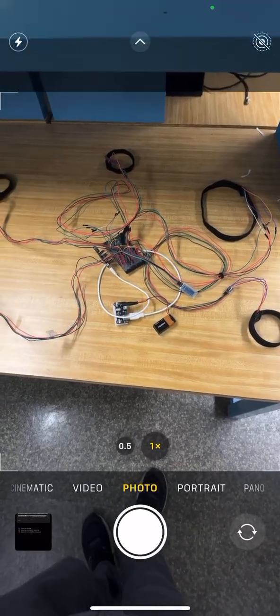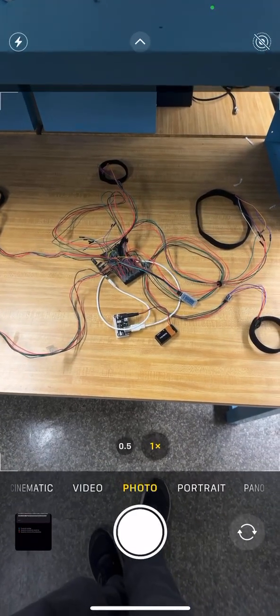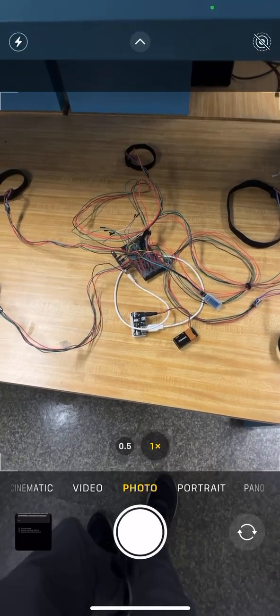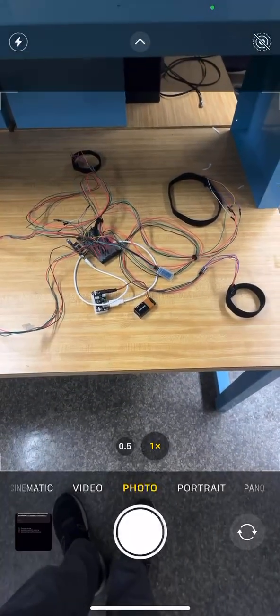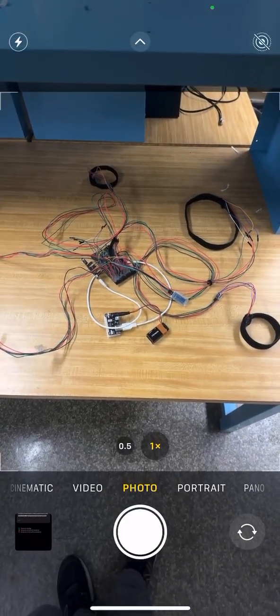Right now it's a proof of concept because the I2C connections are currently unstable and no data is being received from the MPU 6050s on this current device, and also several of the pin connections on the PCB have broken. However, data is being received as all zeros currently. The lack of I2C does not break the code.